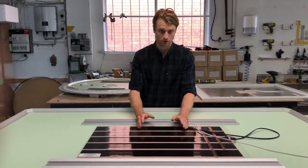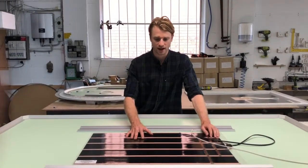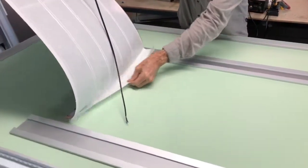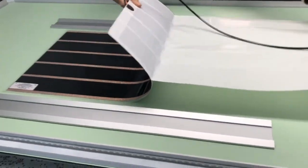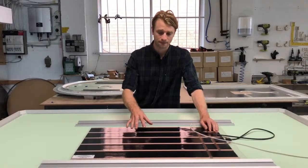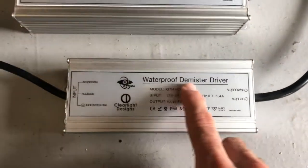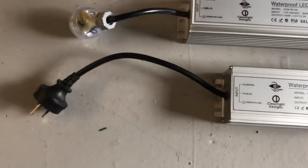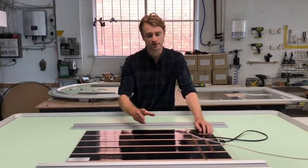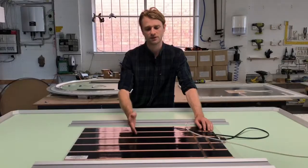One thing not shown on that mirror was the demister pad, which is an optional extra. A demister pad is a metal mesh pad coated in plastic and adhered to the back of the mirror. The metal mesh heats up and transfers heat through to the front of the mirror, so you get a fog-free view when using the shower or tub. The demister pad runs on 12 volts — the same voltage as the lights — but uses a separate driver and is wired to a separate light switch, so you can turn on the demister pad independently of the lights.